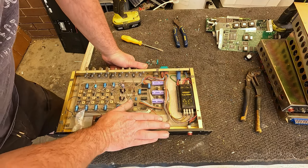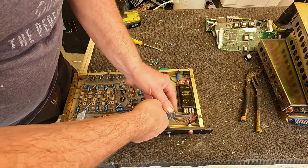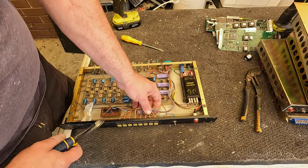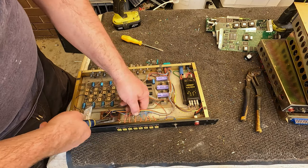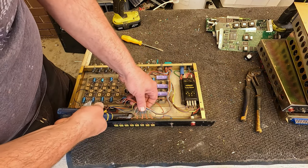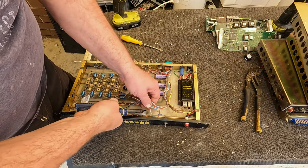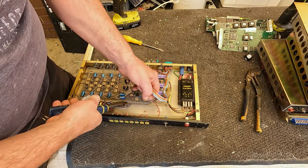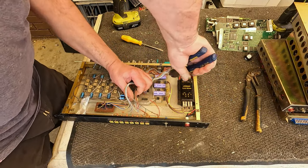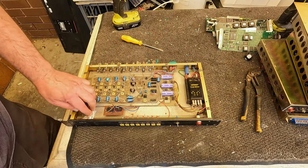These really old transformers — don't open any of them because they've got real nasty PCB chemicals in there. The modern ones often say 'no PCBs' but these old school ones — pretty much guaranteed to have PCBs. Do not expose yourself to that stuff in any way, shape or form. Some guys try to get 20 or 50 cents worth of copper without realizing the damage they're doing — small particles in the air. Don't go there.